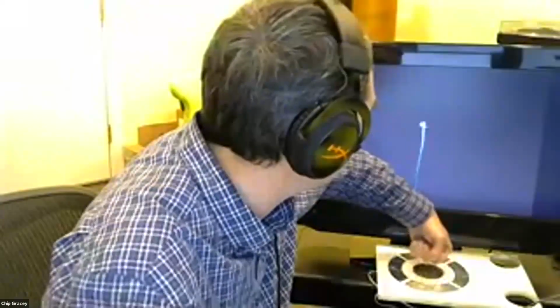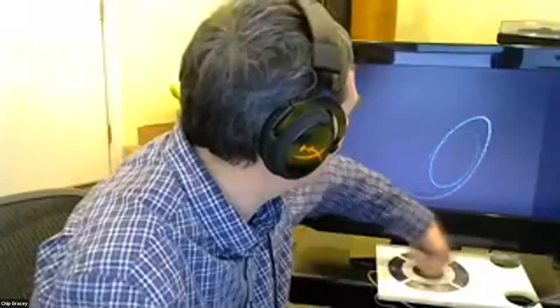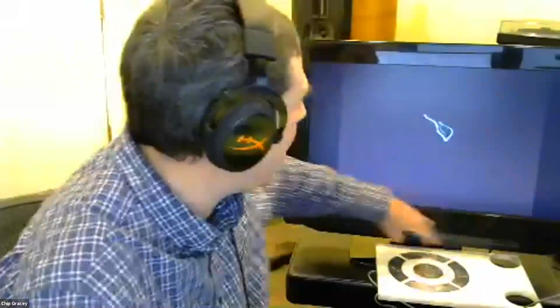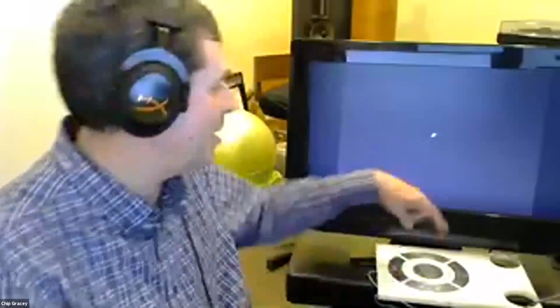Let me re-download. There's something shifty about this whole thing with being in front of the TV, but you can see my hand here. So it's not contacting, right? But my hand is this nice big capacitive kind of plug that floats around, and it variously couples these outer 4-phase rings to the center sense point. So this is kind of one application. I mean, you could do kind of gesture sensing with something like this.